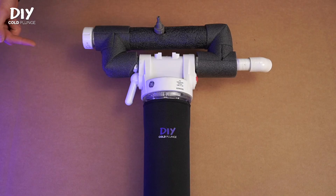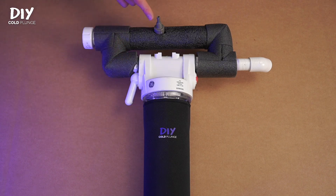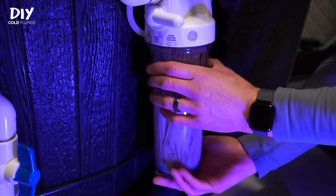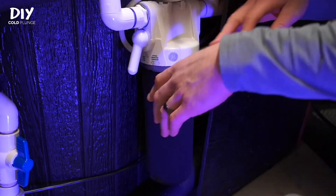In contrast to what we just covered, the more that your filter collects debris, the more water that it sends up through the venturi. You should obviously stay on top of your filter changes, but as your filter collects debris, you don't have anything additional to monitor.